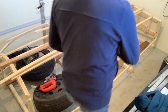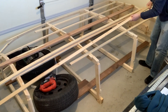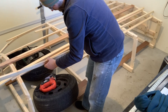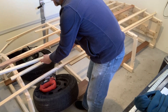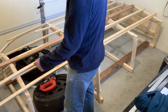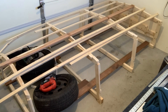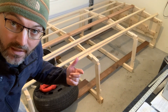I'll continue removing the gunnel. These pieces are good - there are no knots in the bend up here. There's a little bit of awkward grain right here but the grain's still nice and straight pretty much all the way through. This piece has no knots around the bend, so those are good. I can't believe I didn't see that knot before - I wouldn't even use that piece. I'm going to put the brass screw in the gunnel up front, mix up some resin. You've all seen resin before - I'm going to fast forward this part. I'm using three tablespoons of resin and an eighth of a teaspoon of hardener for this because it's just a little bit of surface area that needs to be covered.